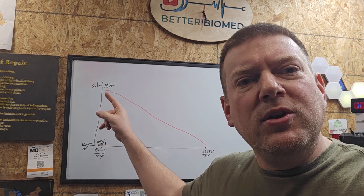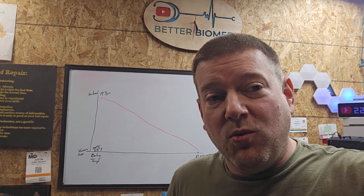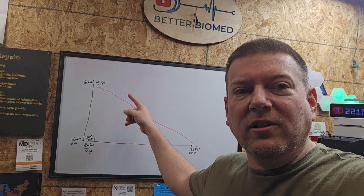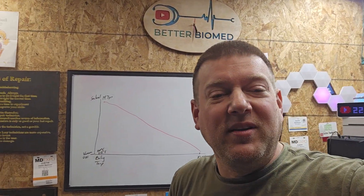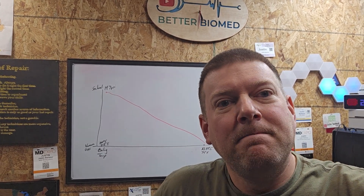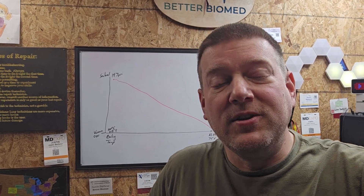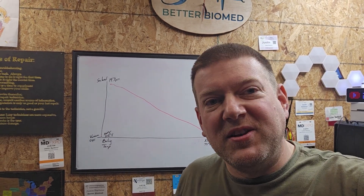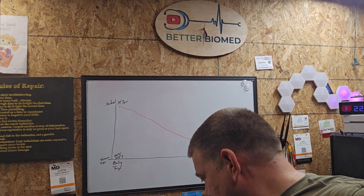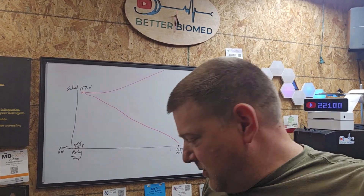The inverse of this is: how do you get water above 100 degrees Celsius? Water boils at 100 degrees and doesn't want to get warmer than that. So how does a steam sterilizer get to 275 degrees Fahrenheit? You add pressure. On this graph, we're taking away pressure and lowering the boil point — but if you add pressure, you increase the boiling point. It's the inverse. A steam sterilizer at 275 degrees is going to be at about 30 PSI. That's how you know if you have temperature, you have pressure — because unless there's a heating element around the chamber, you're not going to reach 275 degrees without pressure. Temperature and pressure are completely related when talking about water and steam.